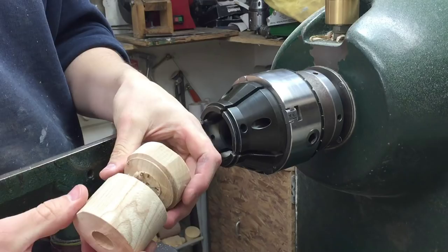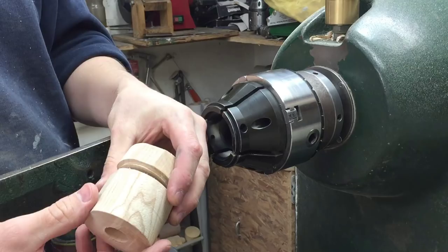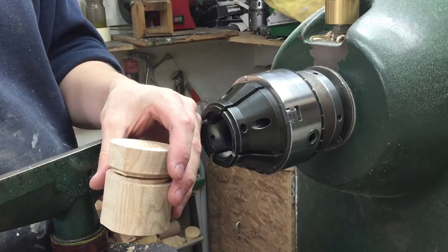What I would do is put the two halves back to back — tenon to tenon — put some tape around the middle, write the date on, and that's it, ready for another day. So that's how I rough out boxes, and that is the first and I think the most important step to good box making. I hope you enjoyed it, and if you did, please subscribe — thank you.